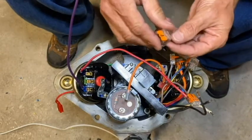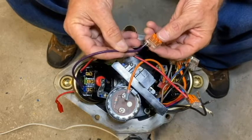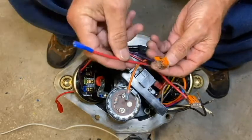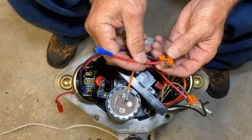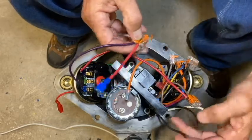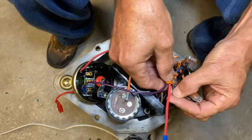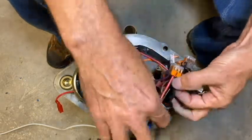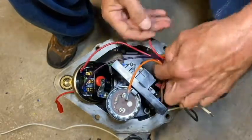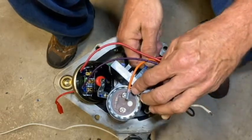Now I'm going to grab the other three-wire lever nut from our kit and take this purple wire off the on/off switch and insert it into one of the positions. I'll take the red wire that came in our service kit and slide it in there, push it down, and give it a little tug. Then I'll grab the black pump cable wire and put it into the third position, locking it down and giving it a tug. I'll then take the terminal on that three-position lever nut and terminate it right down here on the common terminal of the relay on the MCB.